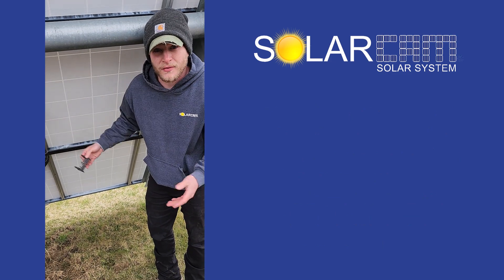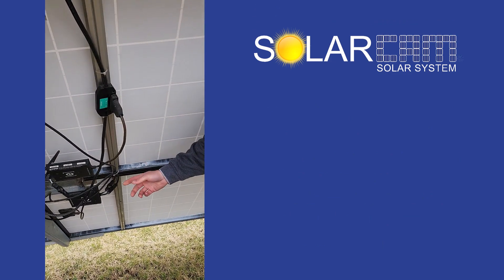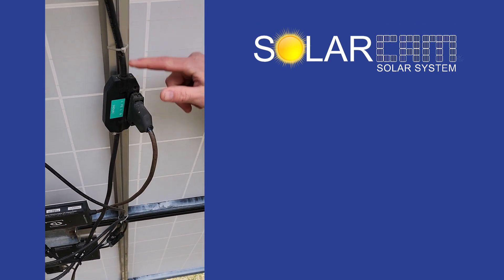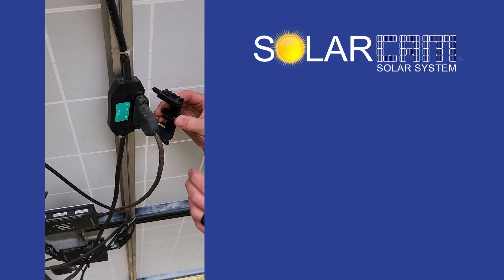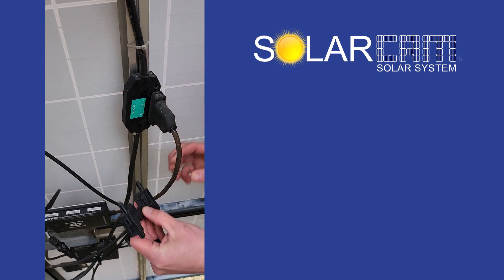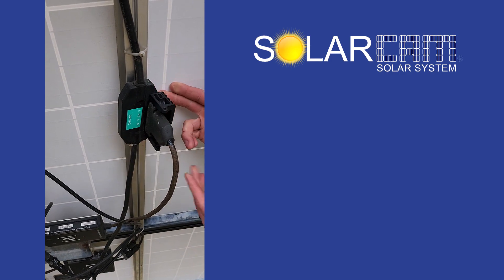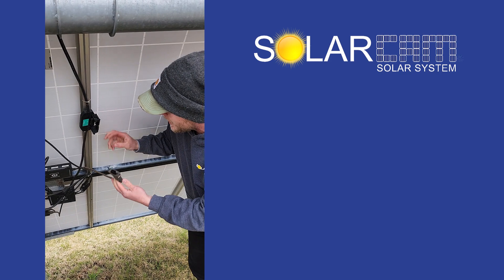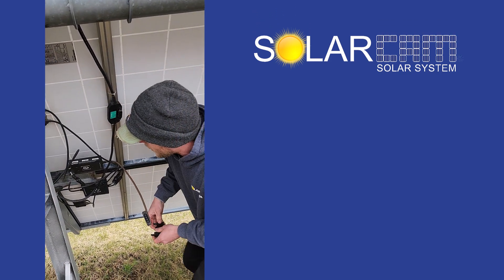After you've identified it, you know what you're going to be doing. You're going to take this tool and look for the plug-in on the side of the inverter. You'll see it follows up into what we call a trunk line, which is your AC power. You're going to take this tool and it slides in either this way or this way. Once it's in there, you'll hear a nice pop as it clicks in. Work this connector back and forth — it can be a bit of a chore, but it should pop out. Once that's out, you've disconnected the trunk line.